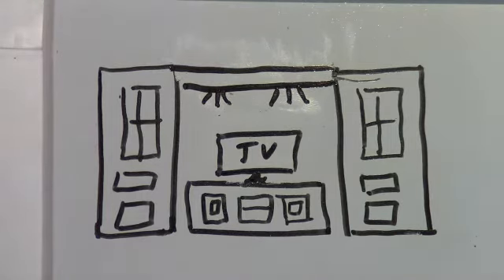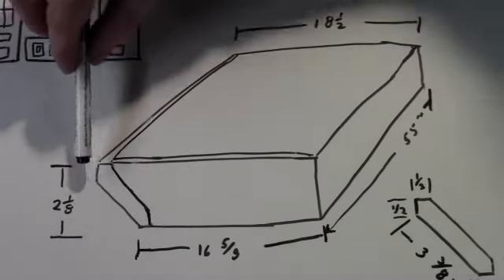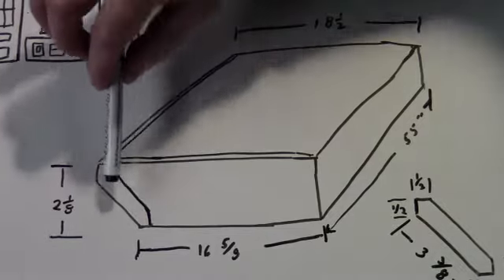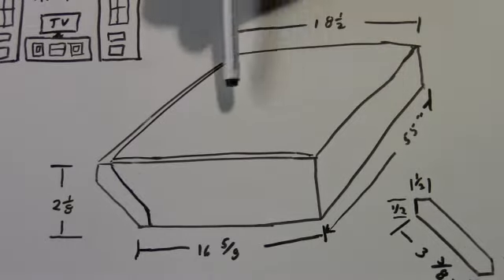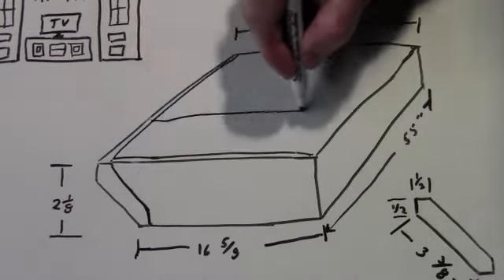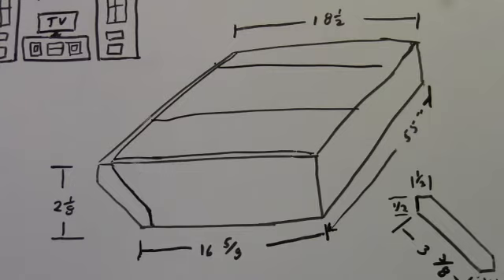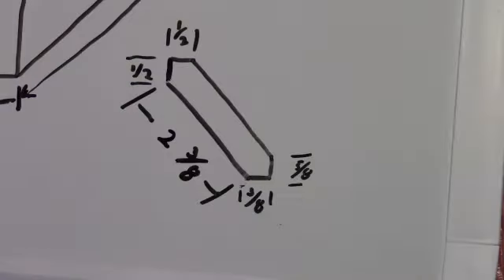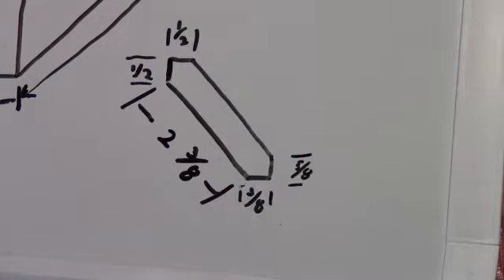The front molding is going to be the only real difficult portion of this project. As you can see, we have a number of different dimensions that we're going to be cutting on this front piece to make everything fit. The front and sides are going to be out of solid red oak. Probably the back will be plywood, and then I'm going to put a couple of internal stringers across to make sure everything stays stable and straight. Here's that front molding piece — I've taken some measurements and laid it out. Luckily everything is on 45s, so this shouldn't be too difficult. Let's head over to the saw and get started.